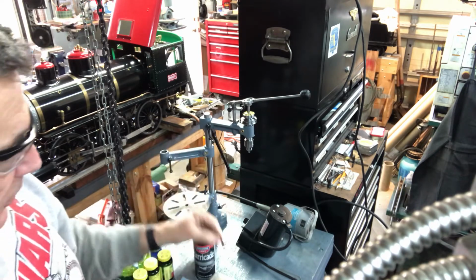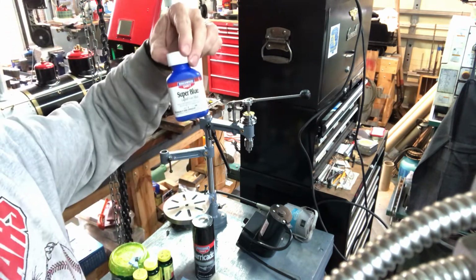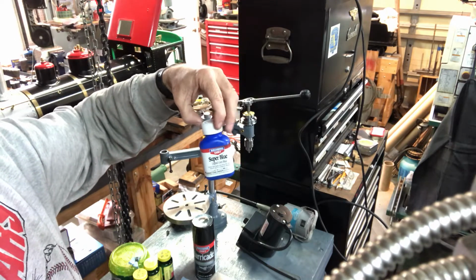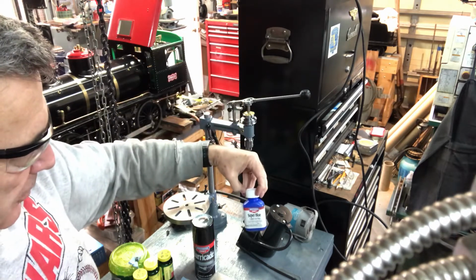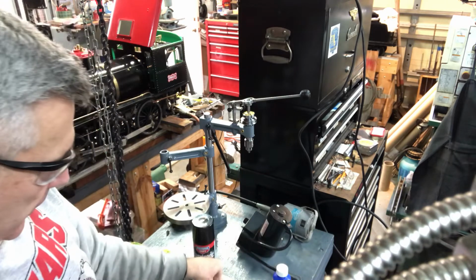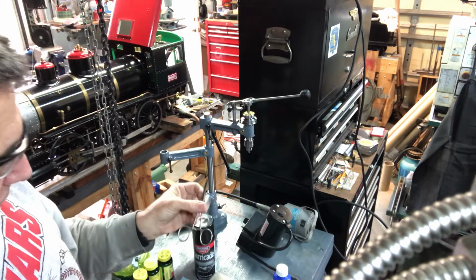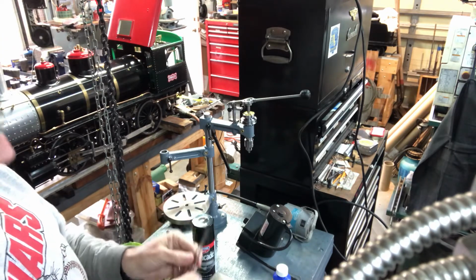And the bluing process is really quite simple. I use this stuff called Birchwood Casey Gun Blue. The first thing you do is to completely degrease the steel, get everything off it. I use acetone for that, and just wipe it off really well. And then you just treat it with the blue. I use these forceps so you don't get the stuff on your fingers, so I'll take a swab and then use these little surgical forceps that I got off of eBay for a couple of dollars.